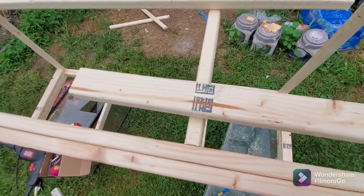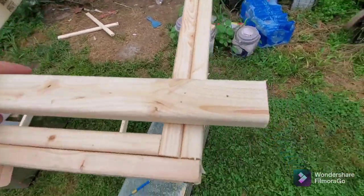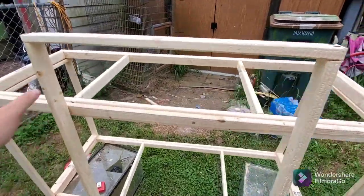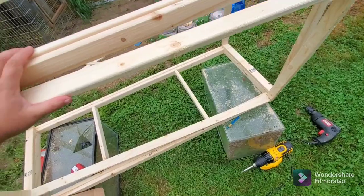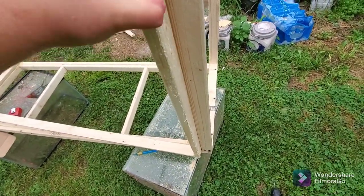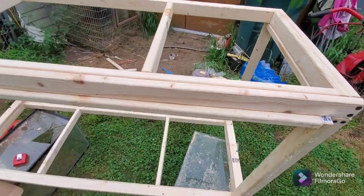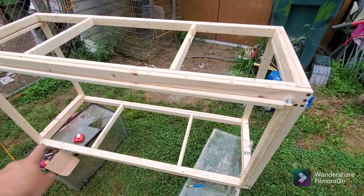When you're ready to put the inner frame in, you want to pre-drill a hole here and here on the 22-inch ones. Pre-drill your hole so it's easier; otherwise you split the wood because it's so thin. Do this for each side. When you build the frame, it should look like this, then just wedge it into place for now. You gotta make one for the side — same thing — you want to do both sides.